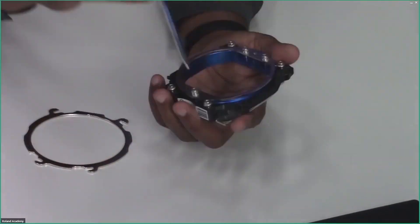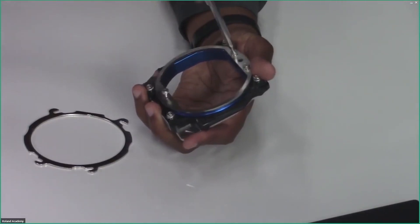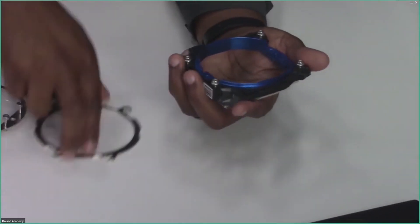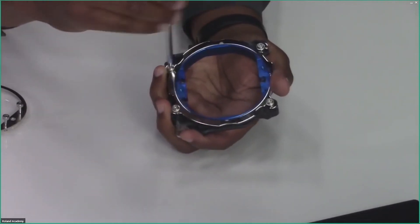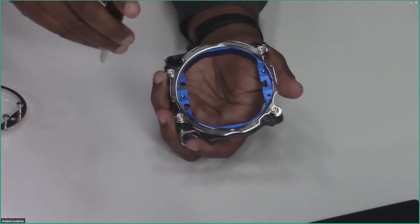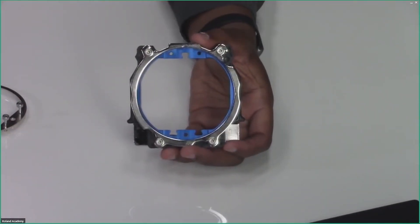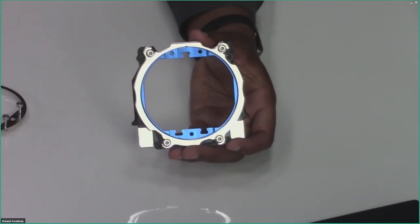Once the jig is turned over and placed down, there is really no give because both hinges are fitting in the proper spot. Now we need to take off the top of the actual fixture by removing the screws fully from the blue portion. That releases the metal fastener at the top. Then we put on the adapter and slide it into place. For tightening the adapter: go down on all four screws lightly, then go back in an X pattern and tighten everything up specifically.